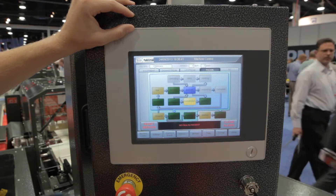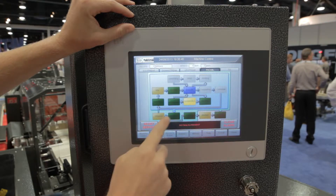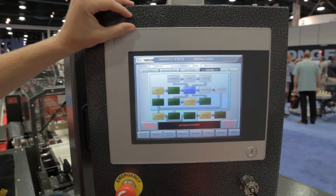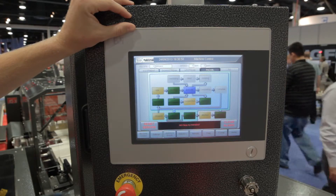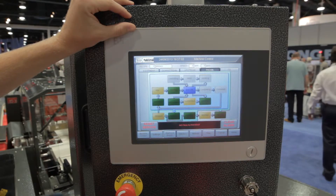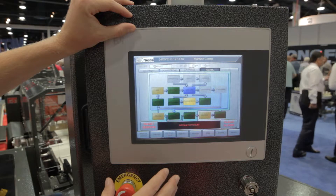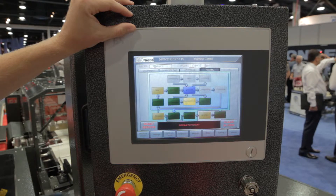If you were in an alarm state, PackML would know and you would end up either in aborted or stopped. This is useful because PackML allows upstream and downstream communication between machinery. So the feeding machine upstream would know it needs to stop sending products to the shrink wrapper because it's in a suspended state, and when the shrink wrapper is back up and running in execute, the upstream machinery can start sending products to it again.